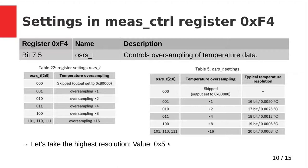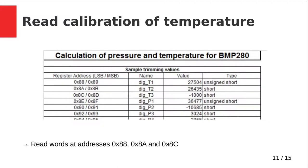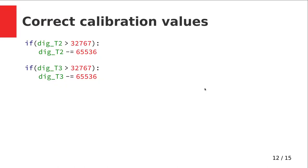Now we are done with the settings for the sensor. We have to care about how to get the temperature value out of the sensor, and here the calibration data is important. The calibration data is one word each — three words total — with addresses shown here. The first calibration value is an unsigned short, and since an I2C read also returns an unsigned short, no typecasting is needed. But the other two calibration values are signed shorts, so we have to do a little typecasting. Here is the sample code for the typecasting — we read the values first and then typecast them.